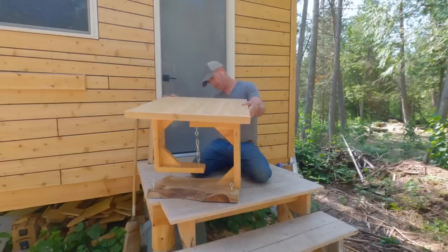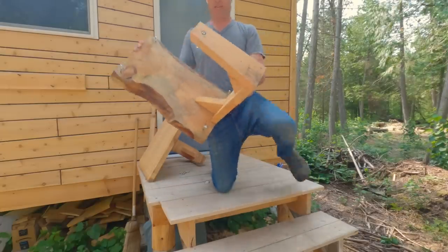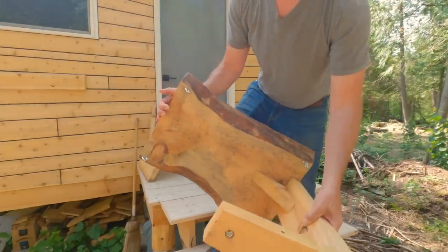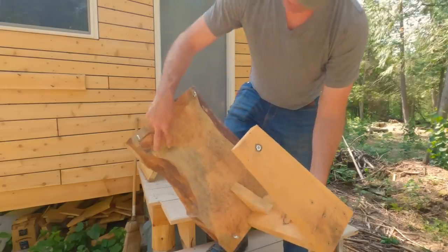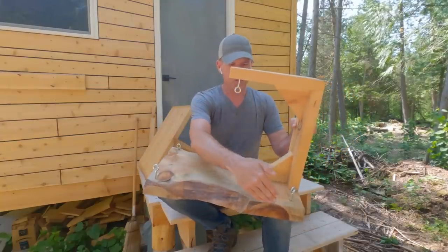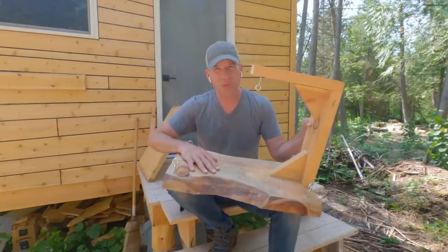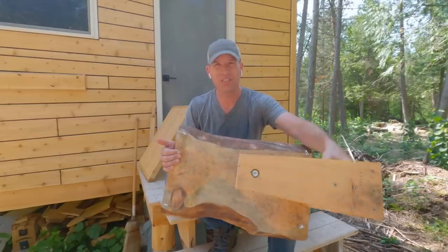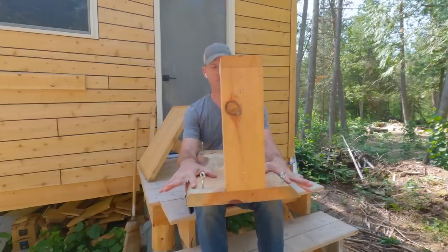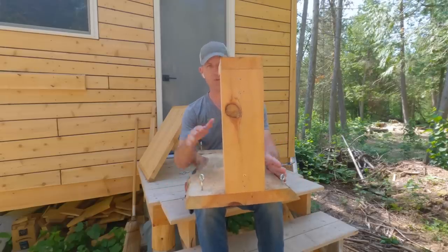I found this down there yesterday and I thought maybe we should finally finish it. I like that this piece of pine on the bottom is actually quite gorgeous — really nice blue in the sapwood there. I was thinking I could just trim this bottom down a tiny bit and then this would fit through the big planer. I think it would be worth doing that. It would look so much nicer. I can have a half inch on either side, get this to 12 and a half inches and push it through the planer.